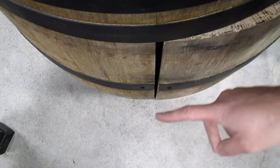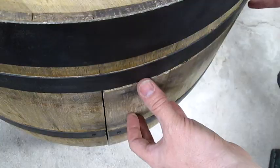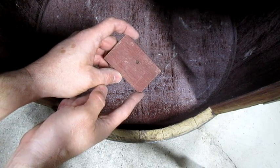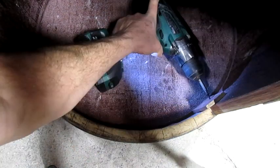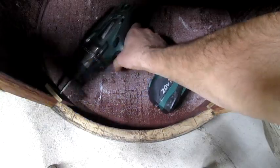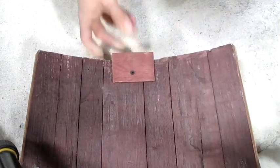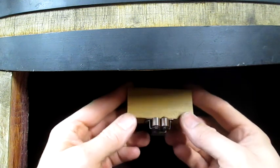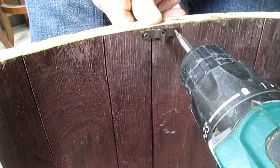We can't really make this a hinged door, because if you open it up like this, the hinges would rip out. So we'll make it a lift-out door instead. Using little pieces of our shelf wood with holes drilled in here, I'll put in stops here and here. I'll also put a stop here on the bottom of the door. These will keep the bottom of our door aligned. We're going to use this device to latch the door on top. I've mounted this piece of it to a board, and we'll screw it in right under here. I'll attach the other part on the door like this.